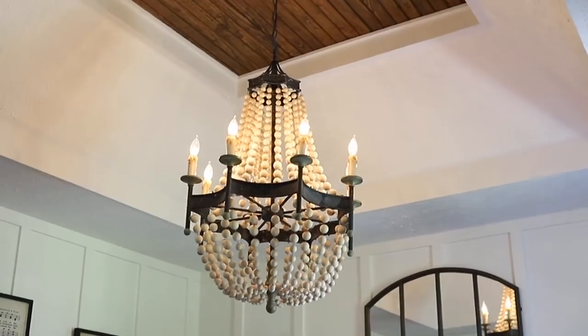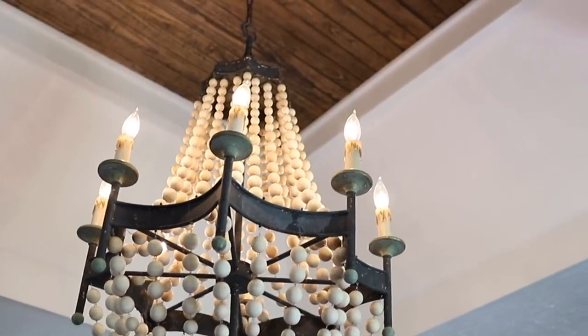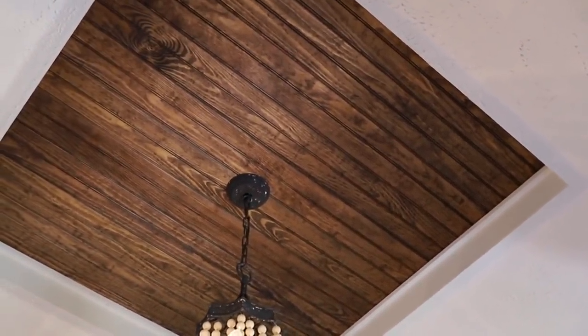In the dining room, he had done the wood walls right after we first moved in, but during quarantine he added wood to the ceiling. It's a small room and you might think the wood would shrink it, but it just warmed it up and drew the eye upward. The lumber had been sitting for three months waiting. You do have to be careful to nail into the joists and not just the sheetrock, but they weren't hard to find. In this room we used the thinner side of the tongue-and-groove — two inches — versus six inches in the bedroom, since there was less ceiling space here.